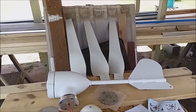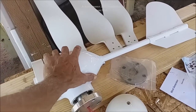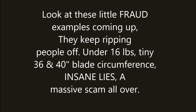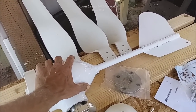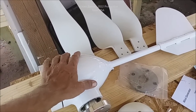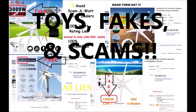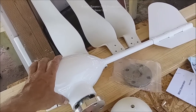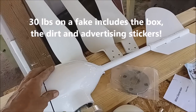Look below the video for the link to where this comes from. Go get the right one. Do not buy wind turbines where if it's a wind turbine I can put my hand on — I don't give a damn who you are, you are not going to get more than 800 watts out of this. This will peak at 800 and run consistent 3, 4, and 5 hundred. But you see these turbines that have got like 2,000 watts and it's like the size of my fist. Magnets and wire matter. Size matters — this thing weighs about 40 pounds. If you see one that says 14 kilos, 30 pounds, and it says 2,000 watts, go to that link below this video and get a real turbine.